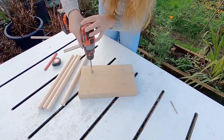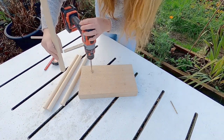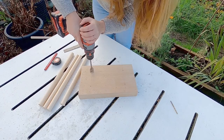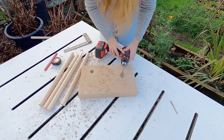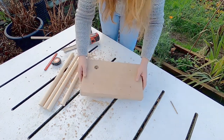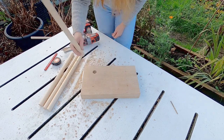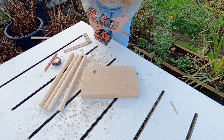This is a really hard piece of oak but these tools go through it like it's butter. The trick with this is you want to go in as straight as possible because we don't want our dowels on the wonk — so just try to keep it as level as possible. And there we go — the dowel fits perfectly, so we're going to do the other four now.